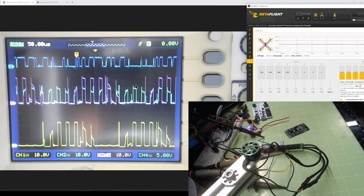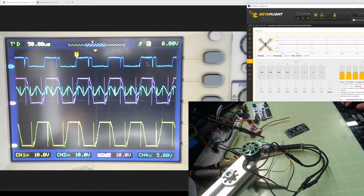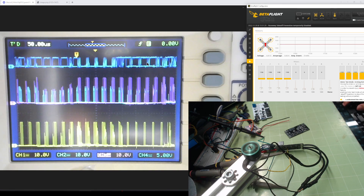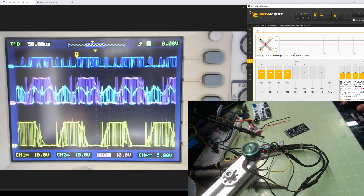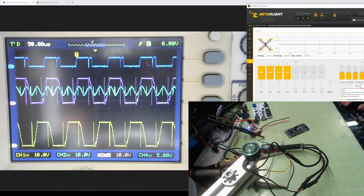You're going into the next phase — the next floating phase. In this instance, it would be this rising edge. So you had a falling floating phase, you were checking for zero crossing going down, and then you're transitioning to check on this one as it's going up. So the faster you go, the easier it gets to detect.